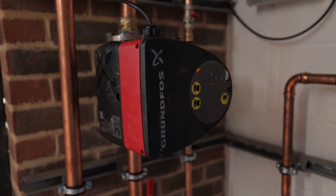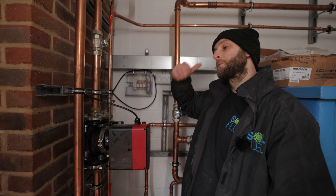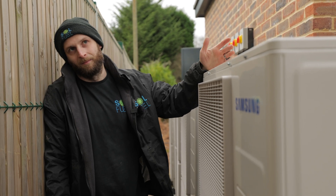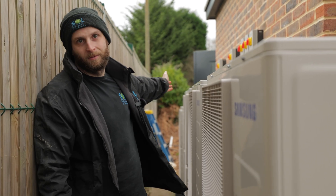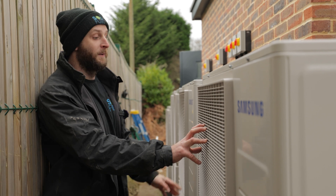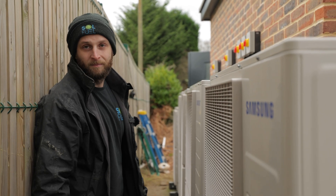Whenever there's a demand for heat from the underfloor, this circulation pump energizes, which also energizes three little relays we've got in here. This is the enable signal for each heat pump — you can't take the enable from there on the same supply because they're on different supplies, so we've got a relay for each heat pump to tell it to turn on. The customer wants to be green and reduce bills. These can be quite costly to run when it's cold, which is why solar is going to be super important — it will help reduce the running cost. In summer we'll generate loads, so the AC units will run for nothing. In winter it may not cover everything but it will certainly help, and the more you use the quicker your payback, because you're maximizing self-consumption.